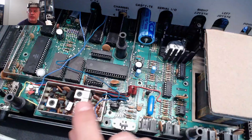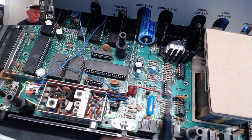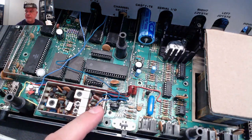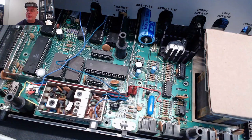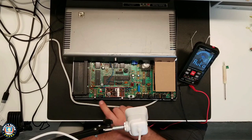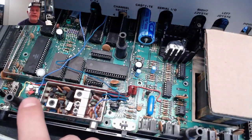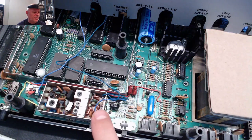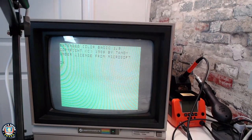This unit is missing the metal lid that goes on top, but once the lid is on it has holes or vents on the side that the wires can poke through, so it's not really an interference. You can remove these wires and resolder that resistor back on the board and your RF modulator will work as before, including the switch. We're not modifying the switch or anything else — just taking the signal from the input of the RF modulator and picking up power from other locations on the board. Different boards and computers will have different locations, but plus 5 is plus 5 and ground is ground.